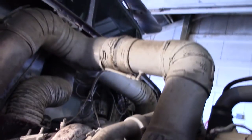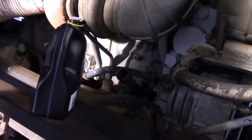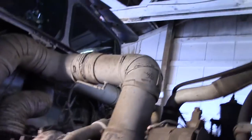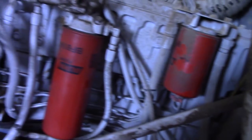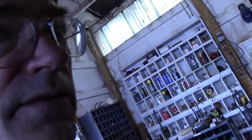I don't know what he said, but it sounded good. So Gabriel is doing the oil change on the old Freightliner — 1985 Freightliner with the Cummins engine. He's just putting the oil right in there. He's already changed the filter, and there's old oil — we're looking at about eight gallons probably in this one. So we're going to go over here and do a really simple but very necessary thing: change the fuel filters on this truck. It's that time. If you don't change the fuel filters, you're going to get dirty fuel and your truck's not going to run very good. Sometimes it won't run at all. It won't even start.